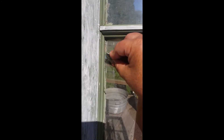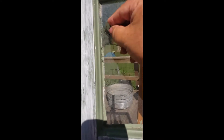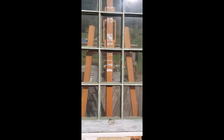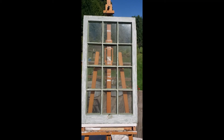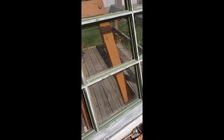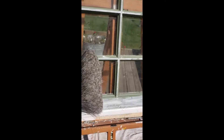I'm going to go through the window with a razor blade and scrape off all this extra green paint around all 12 panes. Then I'll take this hardware off and fix these nails - either pound them in or pull them out - and then put a coat of primer on it. So this is how it looks before I scrape all that paint off. I've scraped all that old paint off, or most of it, and then I just take this big old brush and dust away the debris.